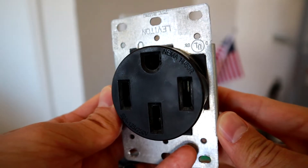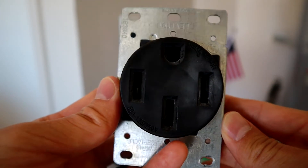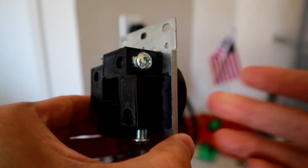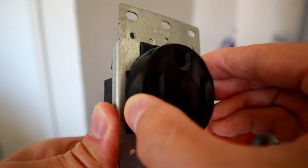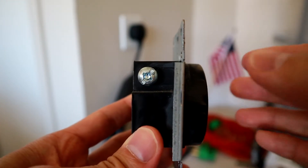Both are linked in the description so you can take a look and buy them if you want. Now, people on the other side will say, 'I've had this dryer outlet for a couple of years and it's been working fine.' I don't doubt that — I'm sure that's true — but having a dryer outlet taking all that power over and over again is going to be a ticking time bomb. If you do a Google search on melting 14-50s, you're going to find unlimited threads of people showing pictures of their dryer outlet 14-50 that melted, because they can't handle this constant power over and over again.